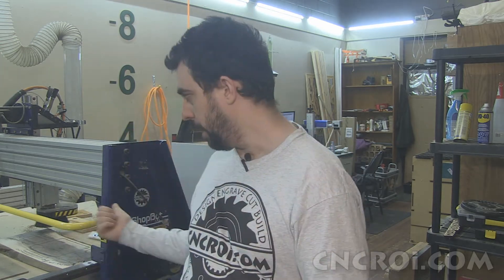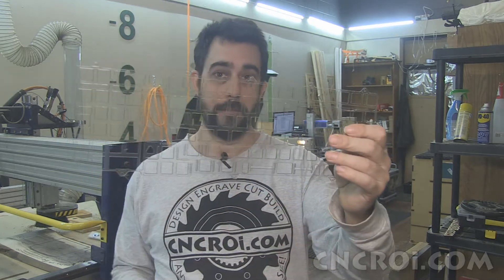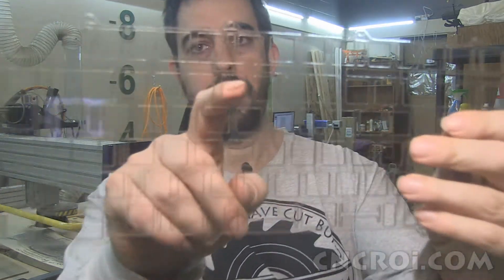The amount of material being vaporized is almost nothing — it's roughly 0.7 to 0.75 millimeters. That's just the amount of material the laser vaporizes. Because the laser, unlike the router and other equipment we have in the shop, cuts directly on the line — not on the outside or the inside of the line, it's on the line. And the amount of material being vaporized made the whole thing on the outside smaller by 1.5 millimeters. On the inside holes it was the opposite effect, because it's cutting inside of the hole instead of on the outside perimeter.